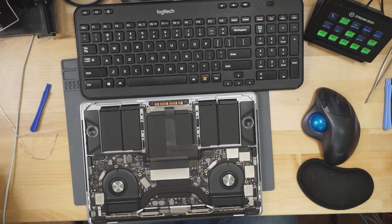Here we have another dead MacBook. Let's figure out what's wrong with this MacBook and see if it can be fixed. The first thing I like to do when working on these devices is unplug the battery. I want to know how much amperage the board is using without the battery, because the battery is going to use a different amount of amperage depending on whether it is fully charged, half charged, or completely discharged.